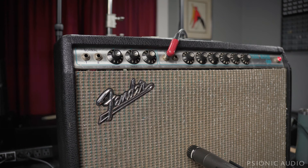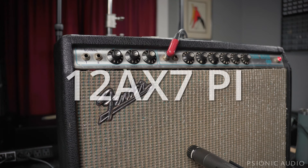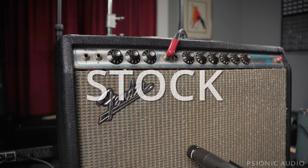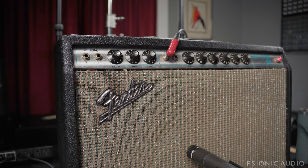All the guitar you've heard so far has been level-corrected in post so that one clip isn't really quiet and the next really loud. But to really hear the differences between the changes we've made, here are clips of stock, V1 pulled, then V1 pulled with a 12AX7 in V6, back to back. I'm going to do it twice because oral memory is short. No level correction applied. I think we'll end it there. I hope everyone found this useful. Consider giving it a like, subscribe if you like this kind of stuff — I appreciate your time. Thanks.